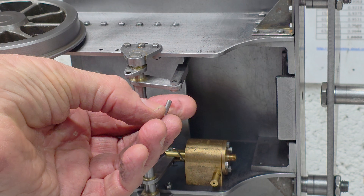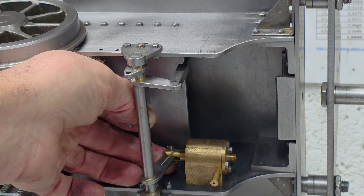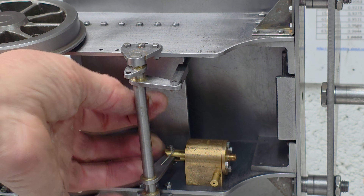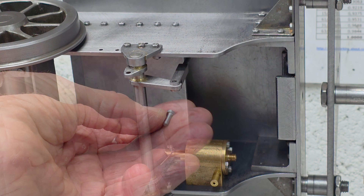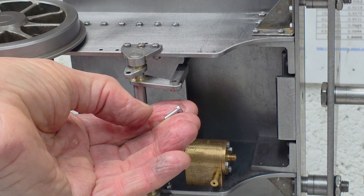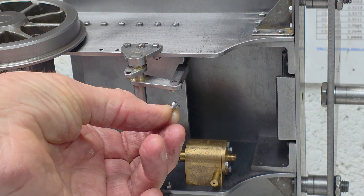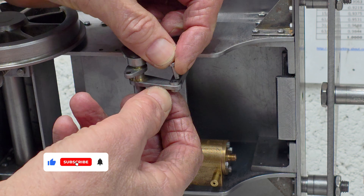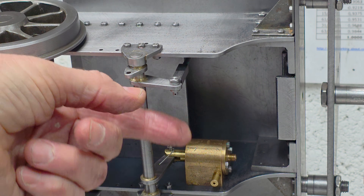Don's design for these pins is much simpler than what I've made — just a bit of 1/8" bar with a hole drilled in either end for a split pin, but getting the split pins on both ends is really quite difficult. So I've made a slightly different one: a larger diameter at one end with a couple of flats milled on it — five millimetres across the flats — so I can hold it with a small spanner, and a 1.1mm hole drilled through the other end for a split pin. I'll replace the one on the steam cylinder in the same way.